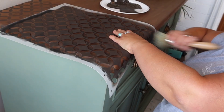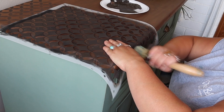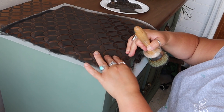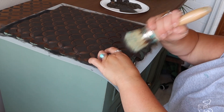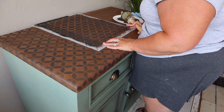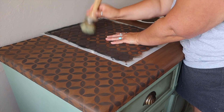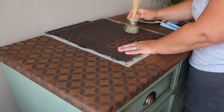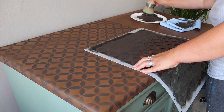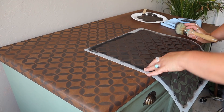This is a really big stencil, great for large surfaces. I left a little overhang on the left-hand side because the top has quite a deep edge. I stenciled the top first, then worked in very small sections holding the stencil with my left hand, tapping a little paint on, moving down, and repeating, so the pattern continued over the lip. I left the stencil where it was, curled it around to do the edge, then matched the pattern at the front by completing the top section first and bending the stencil around in small sections to keep the pattern true and level across the piece.